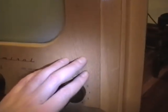Which brings us to this guy, which is a 30A16 from 1948 — a year older than the one I'm working on. This has a cool finish they call limed oak, which was popular in the late 40s into the 50s. It's actually red oak — they rubbed in a whitewash or white paint across the grain, wiped it down so it was sort of translucent white, then put a yellow shellac over it. It's damaged in a few spots with a couple chunks taken out of the top.